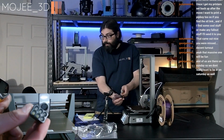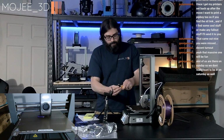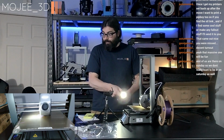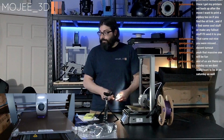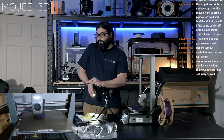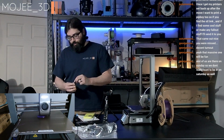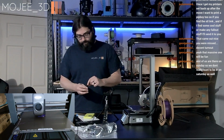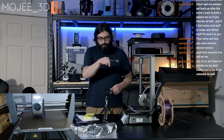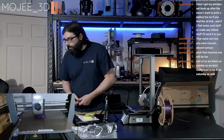this thing here is a little LED, and it sticks on a 9-volt battery, and this is my go-to to check the first layer. Sorry, I probably blasted you guys. You can do bright or not so bright. It's 6 LEDs and it lights up just the 2 middle or all 6. But this is my go-to. But if the toolhead has an LED, you can usually see it without.